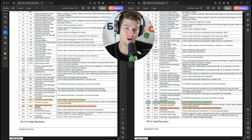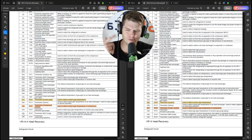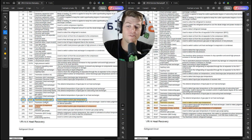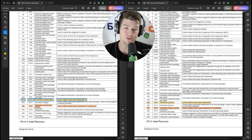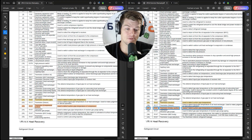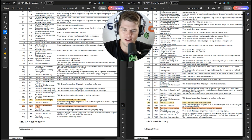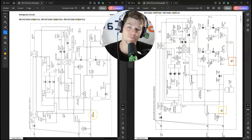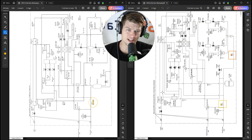The second item is R12T — the compressor suction thermistor. So we have the suction pipe thermistor and the compressor suction pipe thermistor. Two thermistors — great. Same sensor designation on both units, R12T, described as compressor suction. VRV4 just abbreviated 'compressor,' but they're the same sensor in both series.